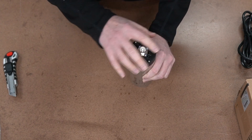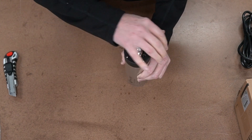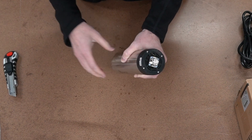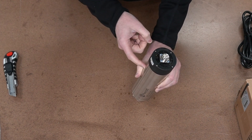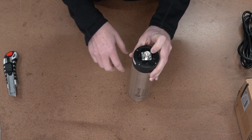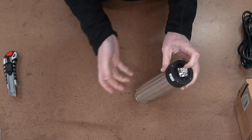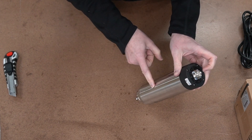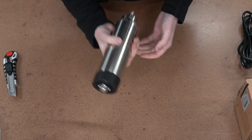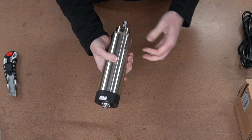You do want to keep this top area cleaned off and make sure it doesn't collect any dust when you're working. The aircraft connector is grounded internally — one of these pins, if you use a voltmeter for conductivity, you can check it from here and match it right up to the body to validate the grounding.